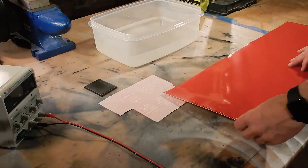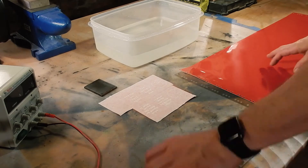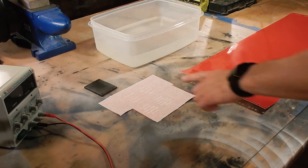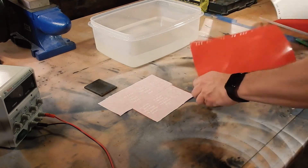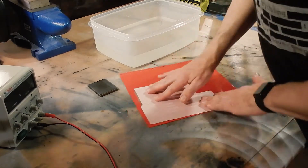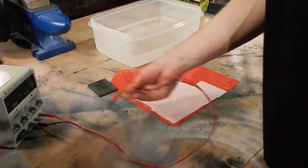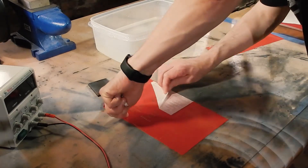I think we're just about ready to get this rolling. First thing to do is finish covering the back of this - cut this up, finish this off, stick it on here. I'm going to leave this part right here where there's copper showing to attach the power lead. You're basically masking off anything you don't want to etch.